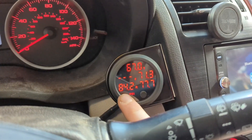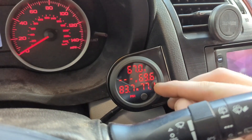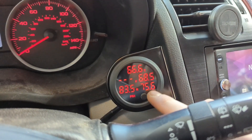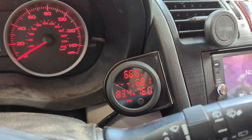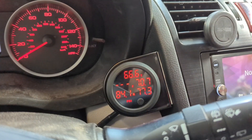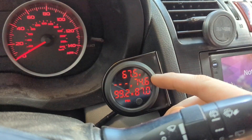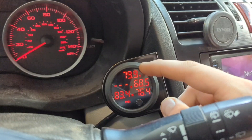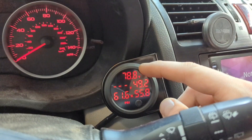As you can see, my cheap oil cooler has almost a 10 psi drop, and the oil filter has almost a 10 psi drop. Nonetheless, you can see all these elements in an oil system produce a pressure drop. If I rev the engine just a little bit, this should go up — and it tracks. But as I let it idle down, you see the AccuSump is holding that peak pressure, or at least it should be. Hopefully it's not all leaking out somewhere.